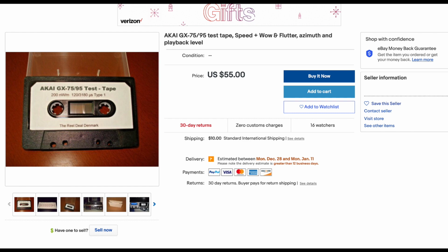But what I do have are 3 different tape decks from Denon, and I'm using them for calibration. This is for sure not very professional, and someone will hate me for this, but I'm going to do it anyway. And this might be a method you can use if you have other tape decks and if you want to check if you're more or less at 3.15 kilohertz.